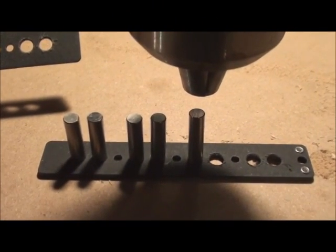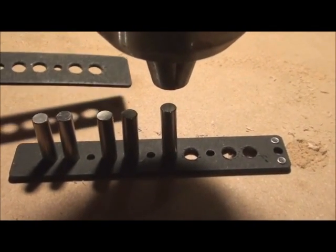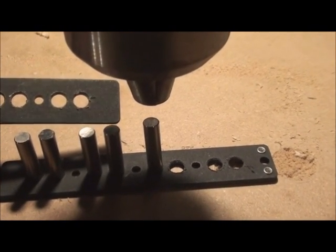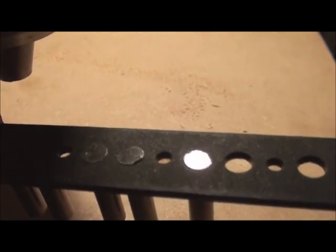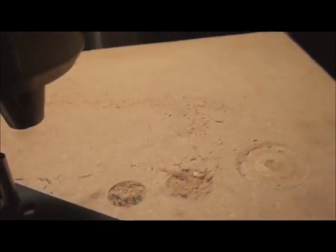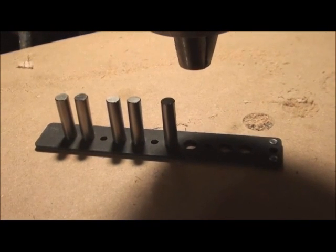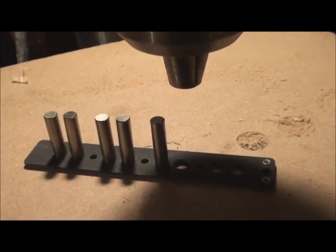Alright, I'm halfway through driving these pole pieces into the fiber board or bobbin pieces. What I do to help with that is I'll take a 1/4" drill bit or something slightly larger than the hole, and I'll just bevel it so that when I'm driving it in, it goes in a little easier and it can sit on its own there, as you can see. Pretty easy, pretty straightforward, nothing elaborate, just down we go. What you'll see on the other side is it'll need a little bit of cleaning up just from some of the material being pushed along with it. Anyways, pretty straightforward, pretty simple. You can almost do this by hand because they aren't really tight in the holes. But we'll continue on, and from here we'll dip it in a shellac as just a barrier before the winding goes on, and then we'll do the actual winding.